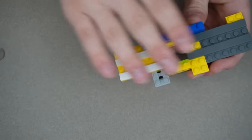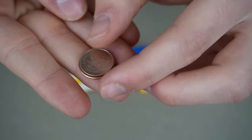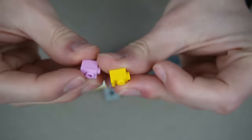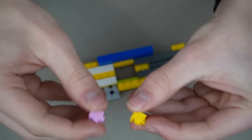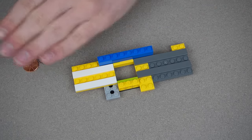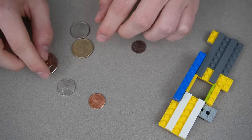I can have that sorting mechanism going all the way down for all six coins. The size difference between a dime and a penny is minuscule — super small. The nice thing about LEGO pieces is they have two types of SNOT bricks: indented ones and non-indented ones, which makes it perfect for handling that slight difference between pennies and dimes.